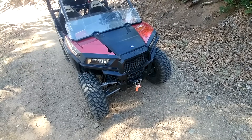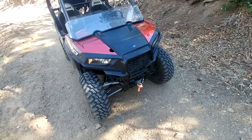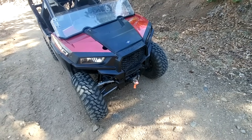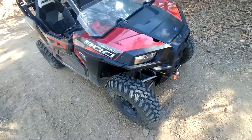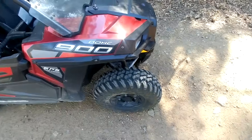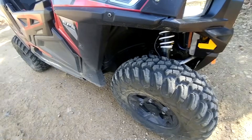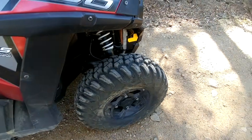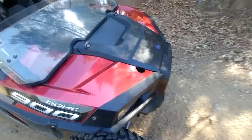I'm going to talk about some of the mechanical things I've had to fix. The first and most important one — if you've seen my other videos — is the radiator getting punctured from behind. That is a design defect on these machines. The tires are fully inboard, which means rocks come off them and ricochet into the back of the radiator. There are a couple of whole videos about that.